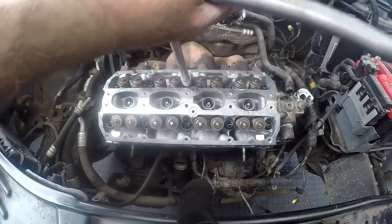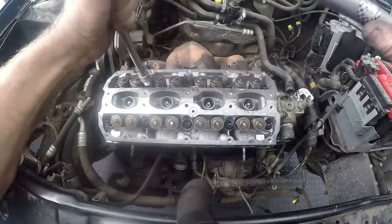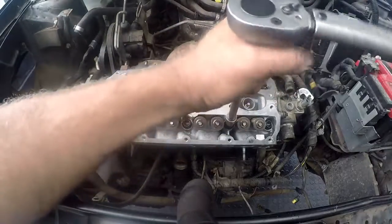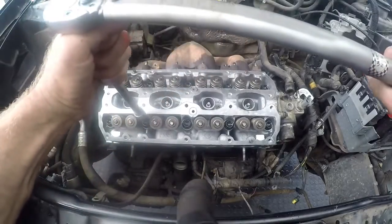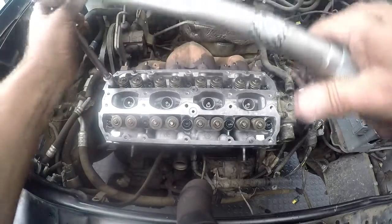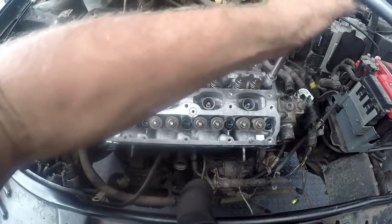This is 40 Nm — you can hear the torque wrench making a nice distinctive click. When you torque down, don't jerk on the torque wrench; let it be a nice smooth movement and stop when you hear the click — that's your tightening torque. We work from inside out to outward. When you are torquing in Nm, you can double-check, but when you torque degrees, you cannot double-check because the chance of snapping the bolts is great.